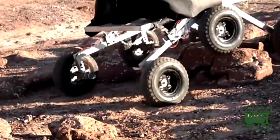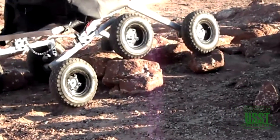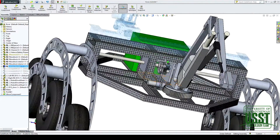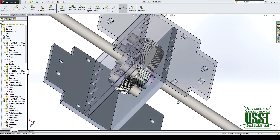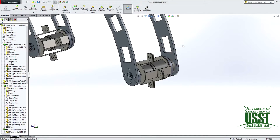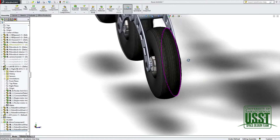We were quite happy last year with the way the Rocker-Bogie suspension performed, so we've taken a really iterative approach to this part of the design. There are three main areas of improvement. The differential is now using helical gears, allowing for much tighter tolerances in the whole system. With the help of simulations, we developed an aluminum plate suspension arm instead of using aluminum tubing, which gets rid of a lot of unwanted forces and makes the rover a much more stable platform. Finally, the in-wheel motors — we're really excited about those. Last year we had some issues navigating rock fields; this year we should have no problem. The motors are completely protected inside the hub of the wheel, so this should allow us to drive pretty much wherever we want as long as the rover can fit over the rocks.